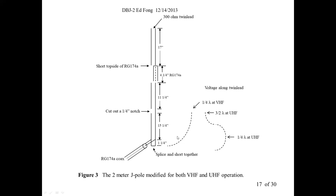But again, if you look at the waveform, it's a short circuit down here, and then it's a high impedance up here because it's going up a quarter wavelength. So if you drive this with a signal, obviously a short circuit is going to be zero signal, right? That's short. But as you move up the quarter wave, its voltage goes up.